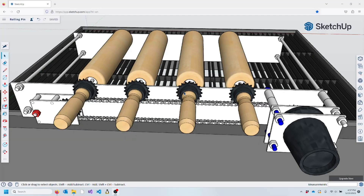This is my concept for the turtleneck machine. It really consists of a very simple chain drive mechanism. You can see the chain going back and forth in a loop. I have four rollers, each one with a gear on it. The gears drop down into the chain and just by gravity hold in place. As the chain moves, the rollers turn. What keeps the rollers from moving along with the chain is that each one sits down in a slot so they can't travel with the chain — instead they rotate.